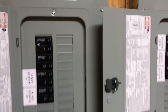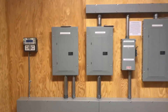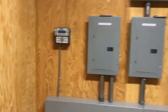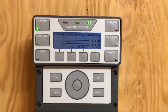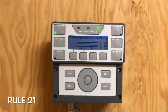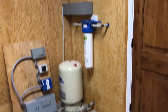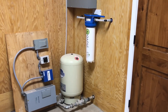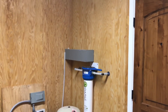That's the AC wiring overview. Here's the whole AC power wall with the Mate 3S controller that controls everything — this is Outback's new upgraded Mate. I think the update was related to Title 21 and Rule 21 compliance requirements, which required a new unit to work with the new inverter. Over in the back corner they'll have all the well pump controls — a VFD variable frequency drive pump for constant water pressure — which will get mounted to the wall.